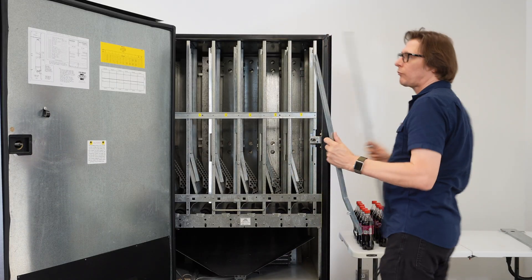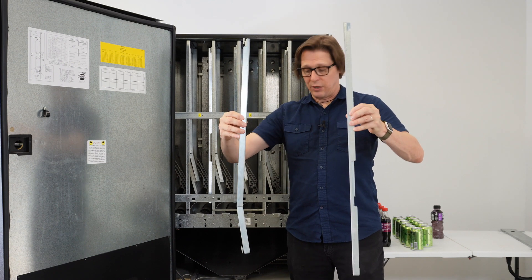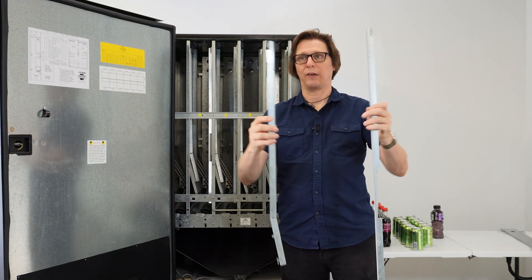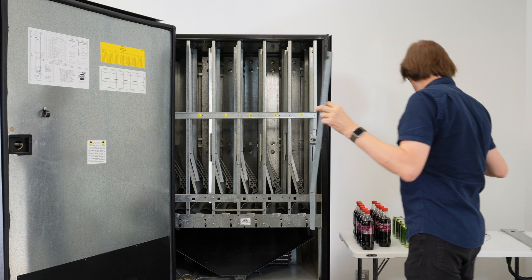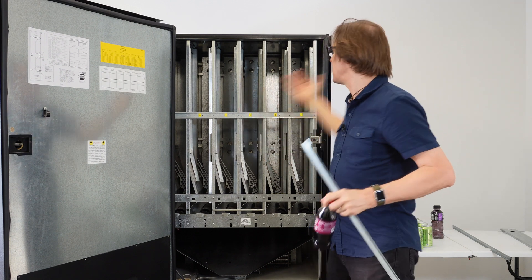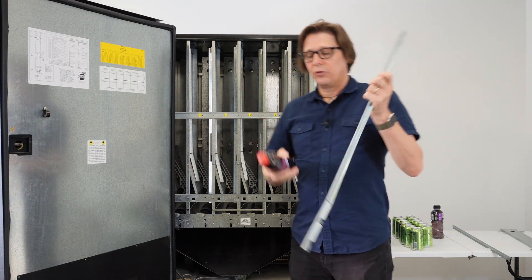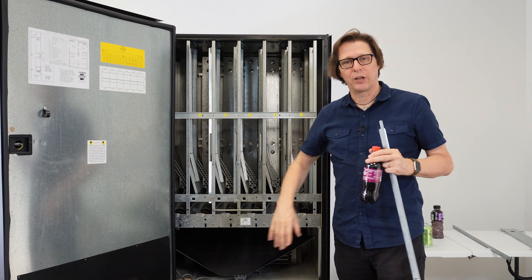On the front set of columns, there are two spacers or adjustment brackets that can be adjusted back and forward depending on the type of product we're vending. I've removed these from the machine to show you what they are — they're just pieces of metal with little hooks at the top and bottom that hook into the side walls of the column. The way the Royal Merlin 4 drink machine was designed, we want all products brought to the center beam of the machine to keep them in place and prevent them from falling out of the column as they shift.